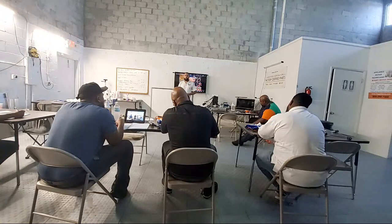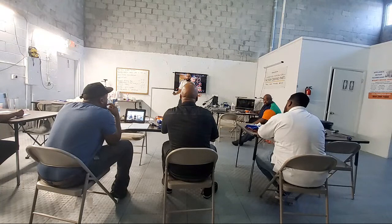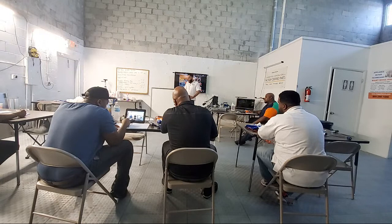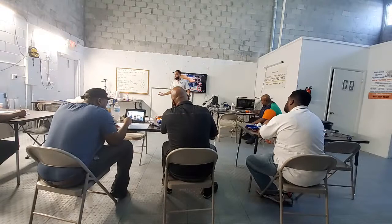Another place that you should look at is the drain tube, back there behind the flap. Does everybody know what that is? The drain? Yeah, the little drain tube. Sometimes they come off, rats will eat them up, and from that rear, you'll get air coming into the unit, causing those kinds of headaches. So it's always good to look at your drains, make sure they're intact, properly inserted, and that you don't have air intrusion coming into that freezer compartment.